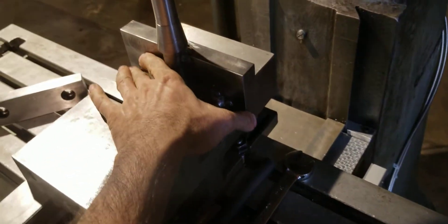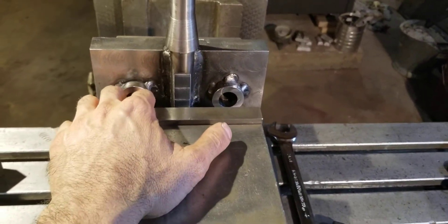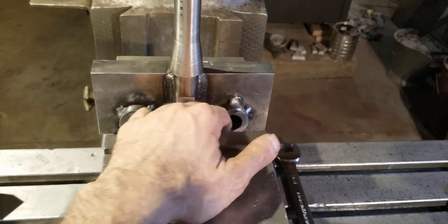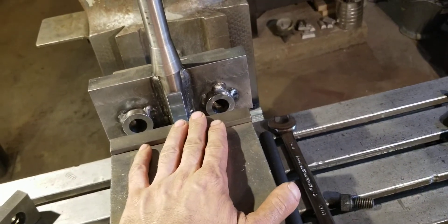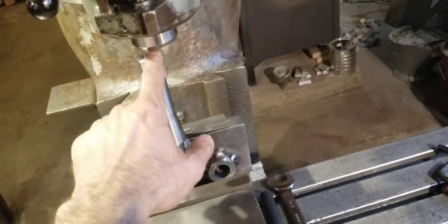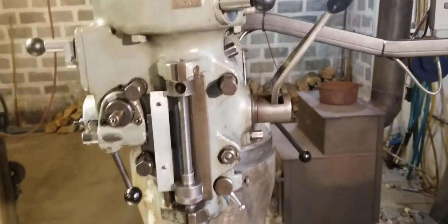This will mount in place as a hard jaw. I've got spacers here too — kind of an afterthought, but I milled everything together so I have a good surface to chuck onto. Not only will the bolts be holding it, it'll be chucked too. I'm pretty sure you could pick the entire machine up by this — screw an eye bolt in there and just lift it.